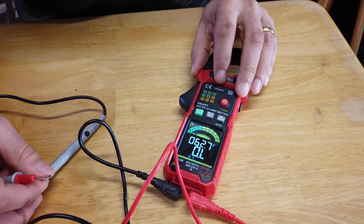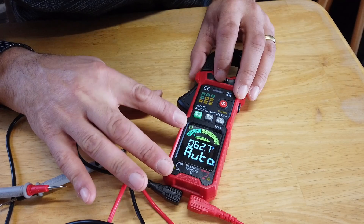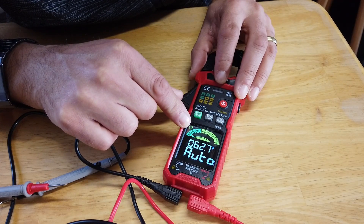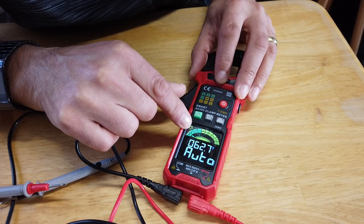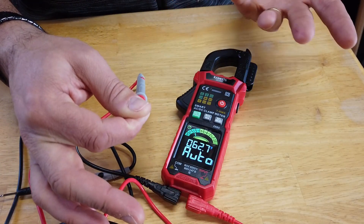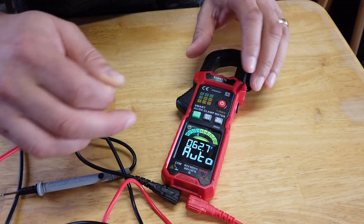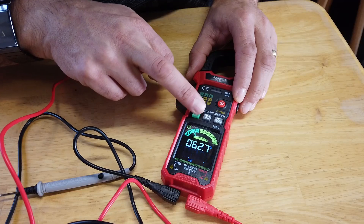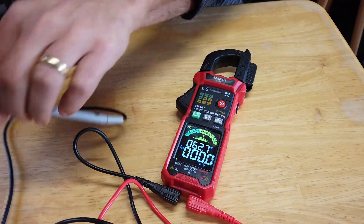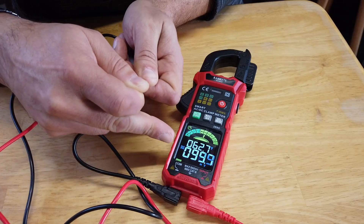We've got continuity and we also have a little visual indicator. The display is really quite clear and easy to read. We've got diode and millivolts — so if we get into very small voltage scales, perhaps it has trouble ranging with millivolts. Some meters, if you just hold one terminal and wave your arm around, there's enough stray voltage in your body to actually give you a meter reading. This one has basically blanked that out. But if we change the function to millivolts, we can see those millivolt readings — we get a slightly higher reading: DC millivolts.